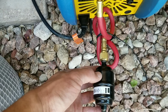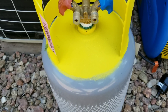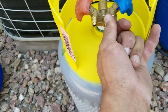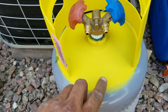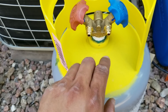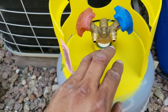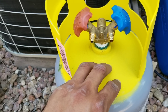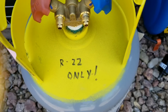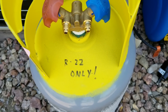You can see here the arrow is going in, and right here this is the inlet or suction portion. It's a brand new recovery tank and right now we're just going to remove this plastic that protects the nipple. You always want to mark on your tank what refrigerant is going to be in here — so for instance this is going to be R22, so we're going to write R22. You cannot mix refrigerants when you are doing a recovery. So if you have one that's R22 and one that is, let's say, NU22B, you can't recover with the same tank — it'll have to be separate tanks. Here I marked it R22 only, because in this condensing unit that we're going to be doing a recovery, this unit has R22.